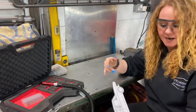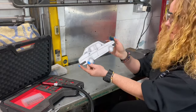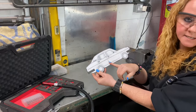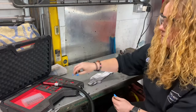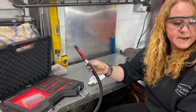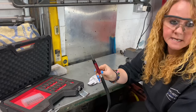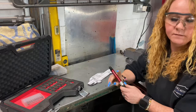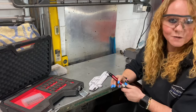Okay, ginger allergy coming back at you - this is where we're at, we've got our shape and I'm happy with that. Next I'm going to try and get some of the detailing using the pencil air die grinder with a carbide tip. I'm going to time lapse it again because it's going to take me a bit of time, so we'll see the finished article soon.